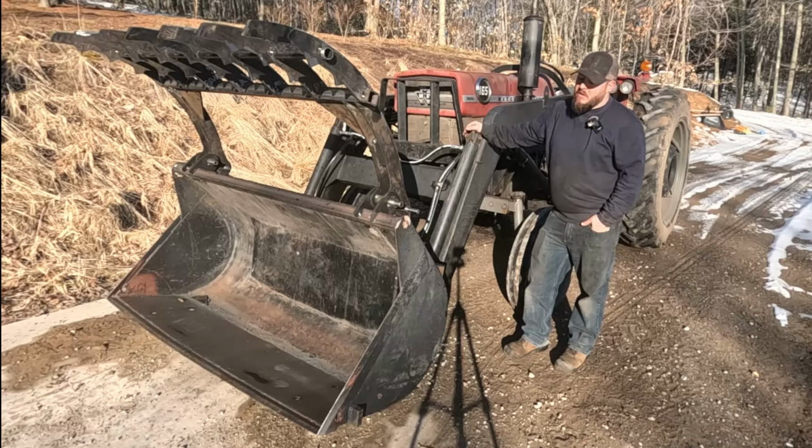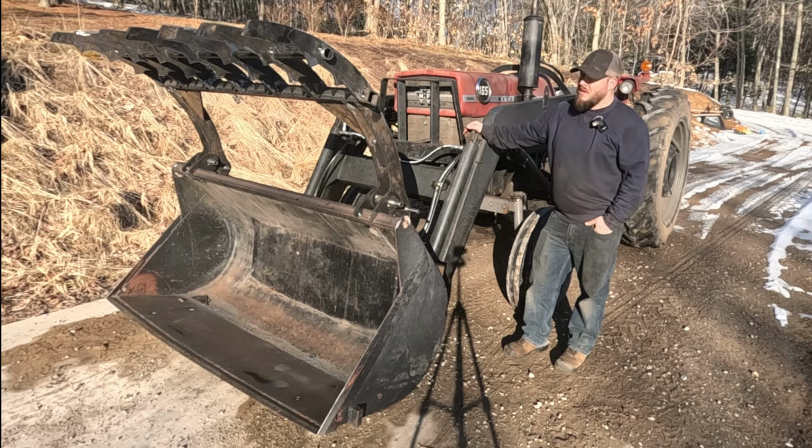Obviously I had a tremendous amount of design work in CAD to get these plates laser cut. And then there's the time to assemble it, which is not just throw it together and start tacking stuff. You need to have thought about what needs to stay in alignment with each other when you're putting this together. So you're probably spending half your time actually welding and fitting and the other half thinking about how you're going to screw it up or how you're going to keep yourself from screwing it up.